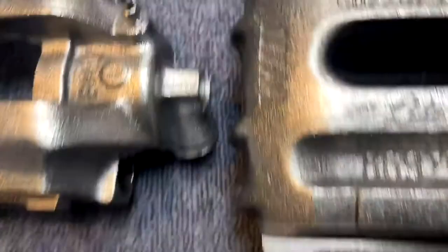Here are the parts done with wire brushes and wire wheels. I used a right-angle grinder and a small 5-amp corded drill with a bunch of wire wheels, and also a drum attachment at the very end to get into a few little spots. Ideally you could sandblast these — it would be easier, might not be cheaper, but would save time. This took me four and a half hours, and that little wire wheel got to my foot between my shoe and my sock, so I'm bleeding a little bit.